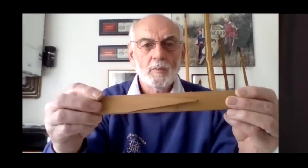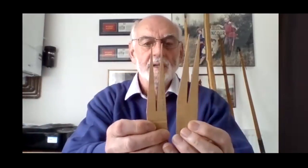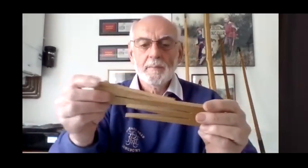We've got a variety of joints we can use, from a simple single wedge like that, to one that we normally use, which is a double like that, but each piece, when you cut them, the shape is identical. That makes it easier to cut, and that fits together. The one in the picture was a double, but as you can see, you've got two different shapes to produce, which makes it more complicated, but it does have a bigger glue area, so in theory would be slightly stronger.